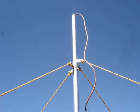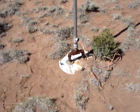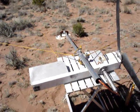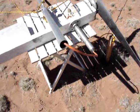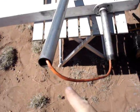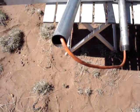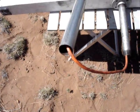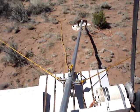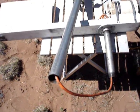Up at the top I've got the wire coming out. Now that I have it plumbed up the way I want it, I can lower the tower down again and install the head, then raise it up and start making some power. What I've done here is lowered the tower by releasing the far guy wire and hinging the tower down at its base onto this little table. This allows me to wire up the turbine head and attach the wires. Then I can just slide the turbine head into the end of the tower pipe here. The one-inch steel water pipe makes a really good slip fit inside the one-and-a-quarter-inch electrical conduit — it makes a really nice smooth bearing that way, it spins inside. It'll spin even nicer once I oil up the pipe a little bit. Then all I have to do is raise the tower back up and make the electrical connections at the base of the tower.